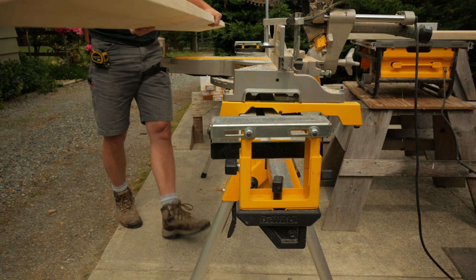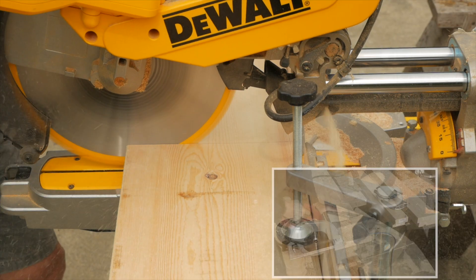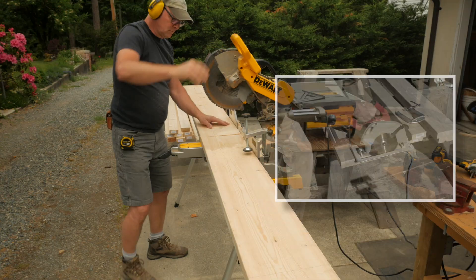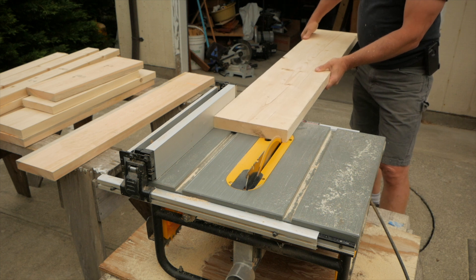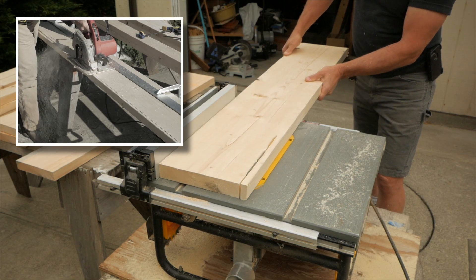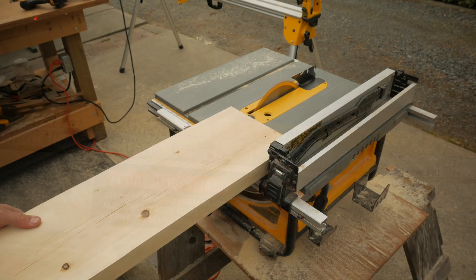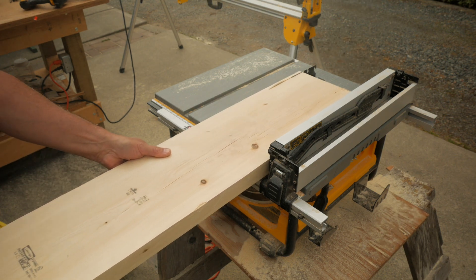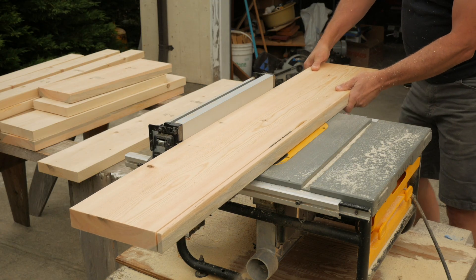I start by cutting a 2x10 to length, then ripping it to width on my table saw. This one will make a 48 inch long panel. I cut these to length with a miter saw, but a square and a circular saw will also work well. To make these new panels the same width and height as the previous Portland cement versions, I rip the 2x10 down to 8 inches wide. I use a portable table saw for this. The forms I'm making are for three different lengths: to cast a 48, a 36, and a 24 inch panel. The drawings have dimensions for each. This offers some variation depending on the size of the garden box. I rip both edges on the table saw to give me a square corner on both sides.